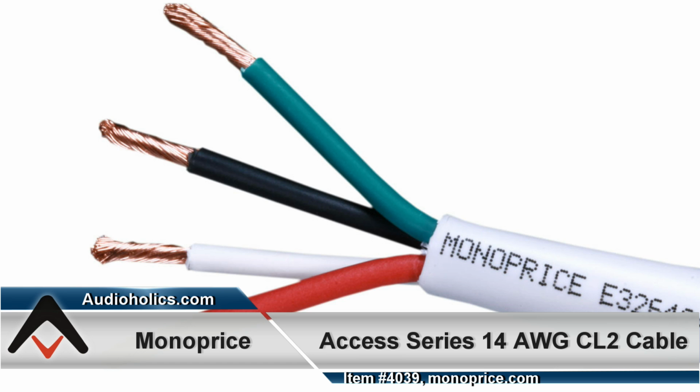Now you have Atmos with the speakers in the ceiling. You've got your front channels and your center channel. But don't forget subwoofers, and we're not just talking one subwoofer. We always recommend at least 2 subwoofers, and you can watch our videos about that. Dual subwoofers give you better modal density in the room. It lets you control and manipulate the room modes, so you get better seat-to-seat consistency. So we definitely recommend you put plenty of pre-wires for subs, and that could usually be RCA level, or if you're doing speaker level and you have the amplifier in your rack, just think it through before you plan the room, and it'll save you a world of hurt.